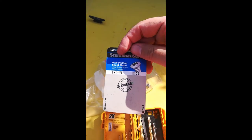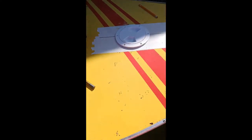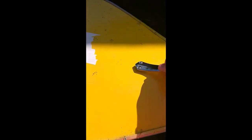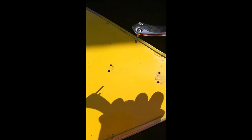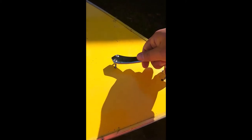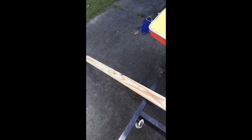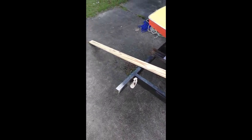Just got back from the store. I picked up number 8, one-and-a-quarter-inch stainless steel screws with the groove down. I used a 5/32 drill bit and moved it around a bit, but all the screw holes go straight down through the fiberglass. I didn't want the screws threading into the fiberglass — I want them to spin freely until they really pull into that backer block, pulling it snug up against the back of the fiberglass with no gap. I also picked up a one-by-four by six of exterior-rated wood as the backer block — that should be plenty for this application.